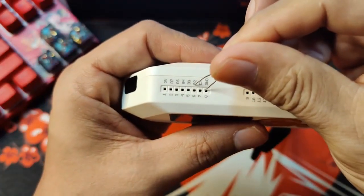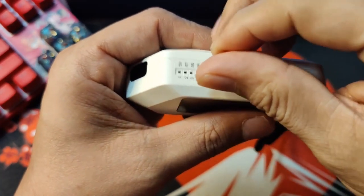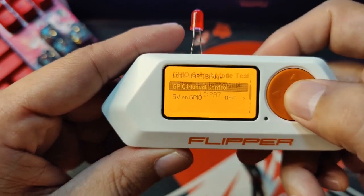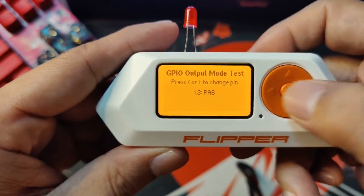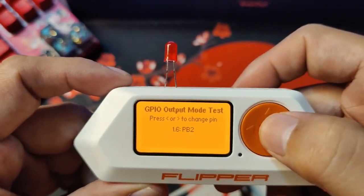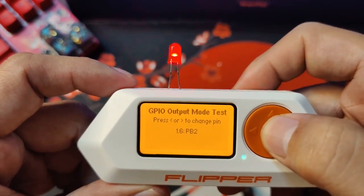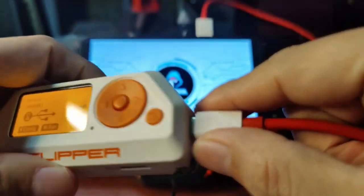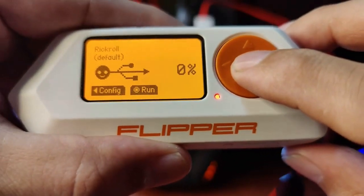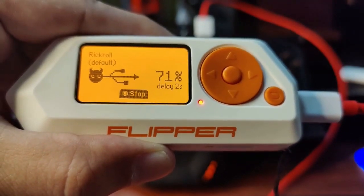This short wire will be on the ground and let's put it on V2 like this — GPIO. GPIO manual control, and let's go to where we put it, which is B3, and just click it. As you can see, every time I click it, it will turn on. I'll just plug it in and trigger it to run.